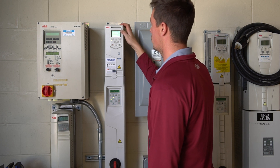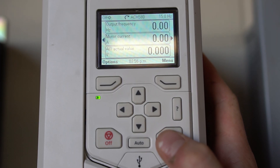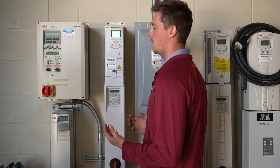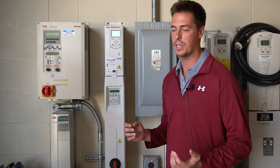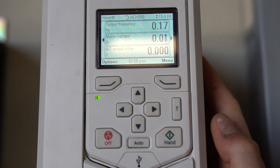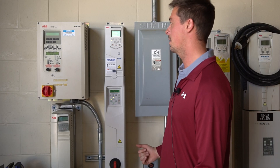Now we can go to our drive and hit the hand button when we know it's safely okay to check the rotation of our motor. I don't have a motor hooked up right now, so when I hit hand it's not going to do a motor identification run. But if you were hooked up to a motor, it's going to give you a warning that says 'first start identification run' — let that go through and allow the identification run to be performed. Once it's performed, your motor will start to spin.